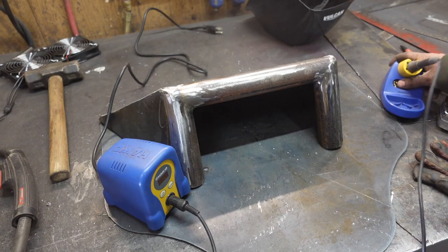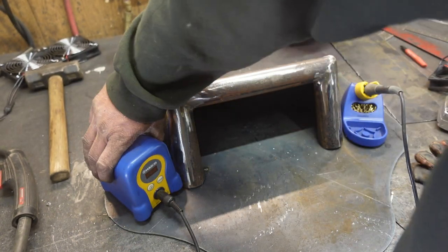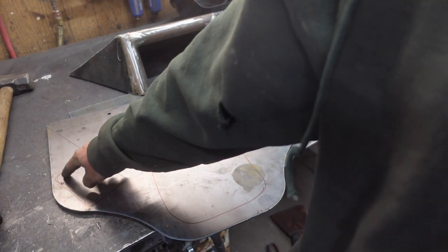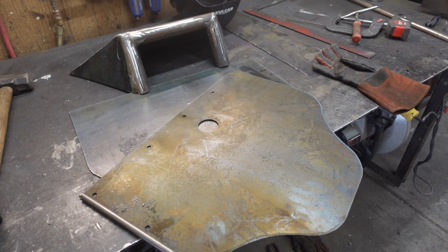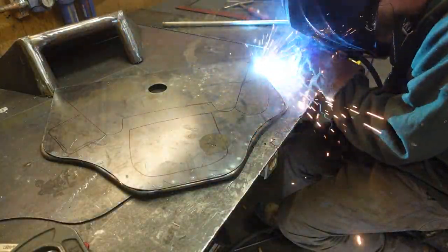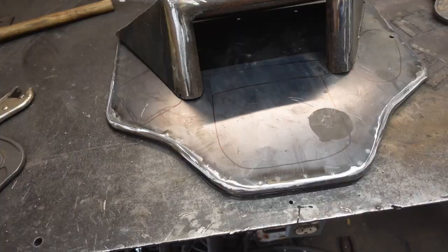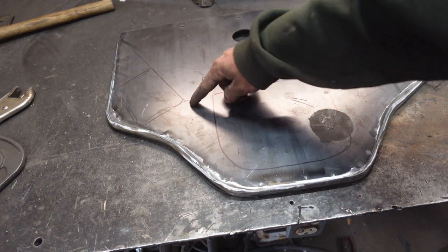Now I want these two guys sitting in a recess of sorts, and I kind of like them angled in like this, which saves me from cutting into the corner here. So I've cut this sheet out of 16 gauge and I've roughly marked all the cuts I need to make on it. But first, I'm going to weld this round stock around the edge so I can grind it down and give it more of an organic edge. All right, we got a nice rounded edge on here now — now we can cut all this out.